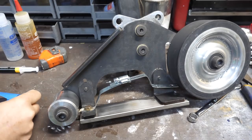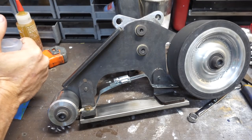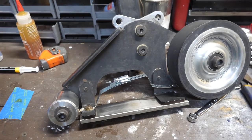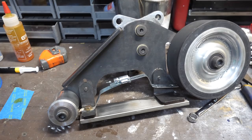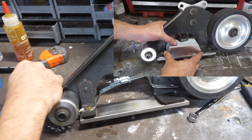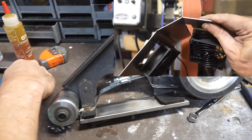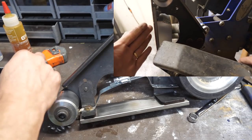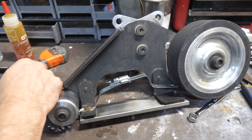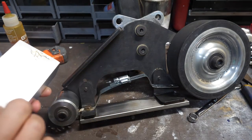Good idea. If you're curious about what's going on here, go check out the first video. I'll put a link below. We've been testing whether or not an aluminum heatsink and a computer fan can sufficiently cool a platen on my 2x72 grinder while grinding a prescribed volume of these 4140 steel bars that aren't hardened. We fixed the heatsink to the platen mechanically during the last video and with thermal tape. The mechanical joining worked better in that case. The computer fans, well, they didn't do very well, in part because we couldn't put them right over the heatsink. We jerry-rigged my shop vac blower, and that did really well. The front of the vac does my dust collection, while the back can cool the platen. You know, it's got a suck and a blow function, so it's sort of an all-in-one device.